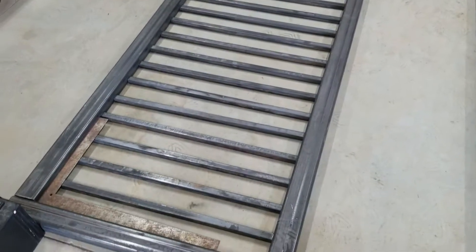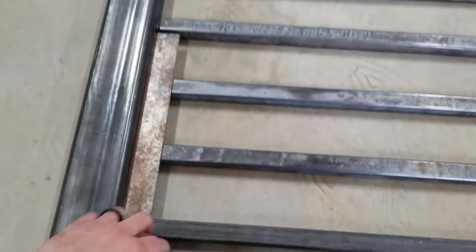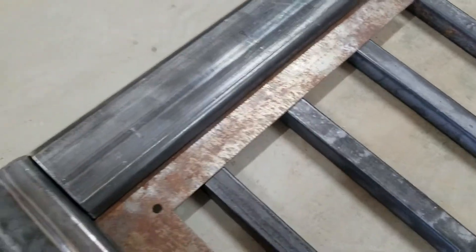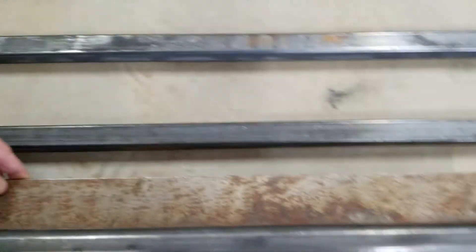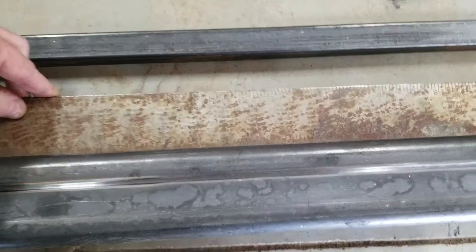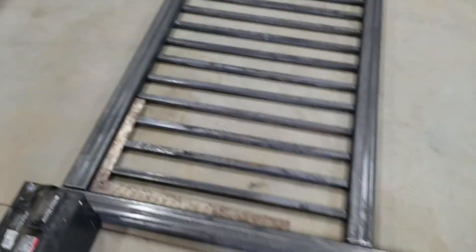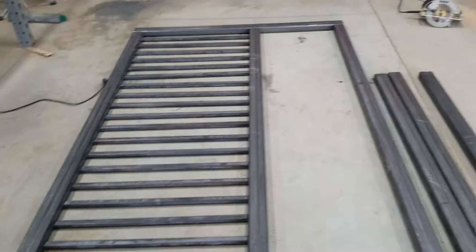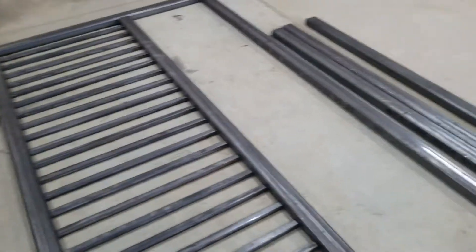Here are all the pickets spaced out correctly, but right now nothing's welded or tacked or anything. I'm going to try to square this up — and you can see right now it is absolutely perfect. No gap, no gap. While it's being perfect, I've got the old batteries out here making sure it doesn't move. I'll square everything else up, then measure this open side for the rest of the pickets.